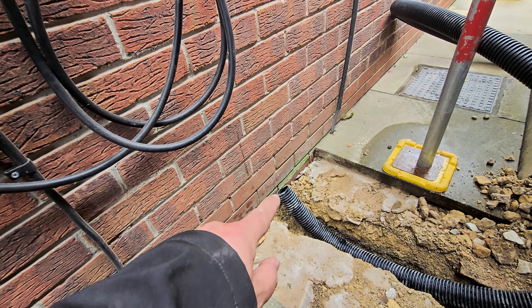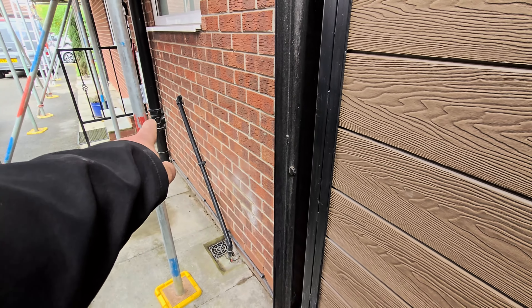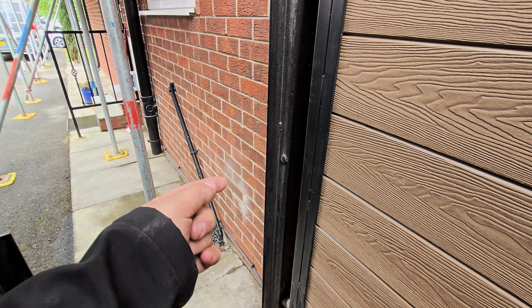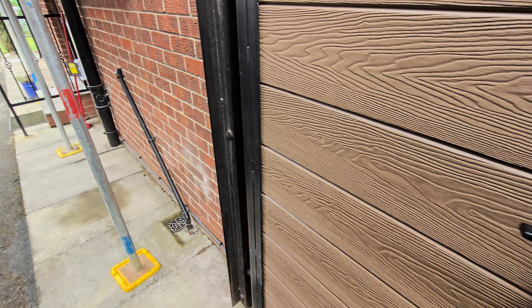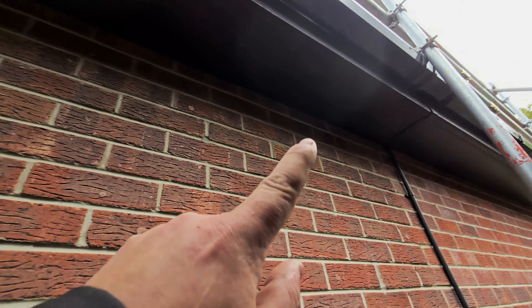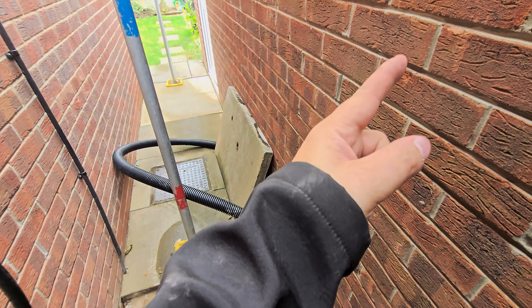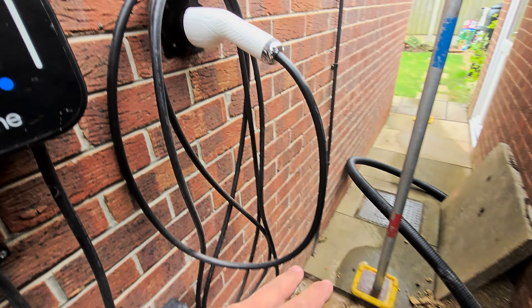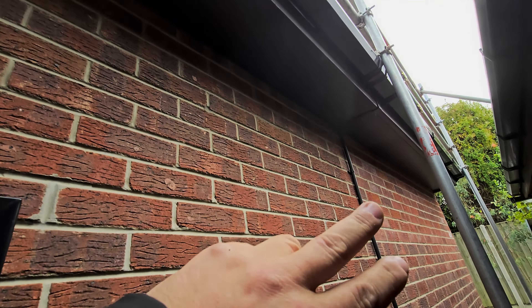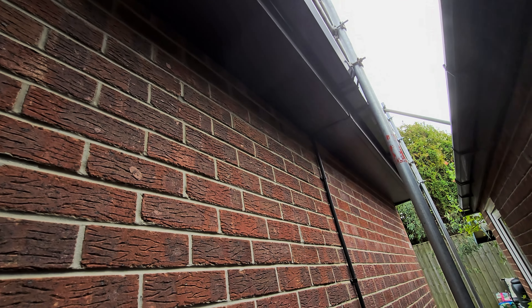Just behind the wall is a fuse box consumer unit with spare ways in it — it's odd that they haven't made use of that. We're going to go up into the loft, run across, and just drop down into that cupboard with a switch fuse which will pick the main tails up off the grid. Into the switch fuse, out through here, into the gateway, and then the gateway will return that power back to the house loads and the house consumer unit. The DC strings go straight into the loft and into the arrays. We'll also take a data link cable across in case we need to add a TAP.